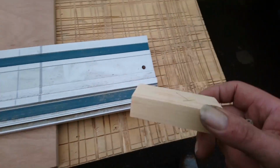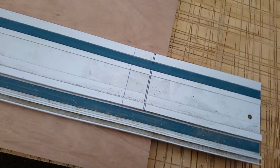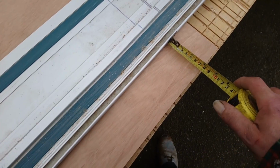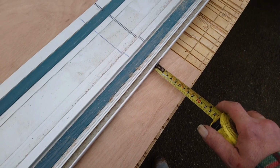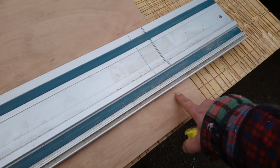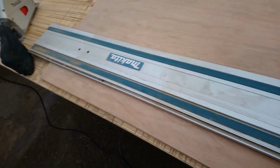No, I've just cut one. Go in there. Won't be needed, but save it anyway. And then for the fascia, I need 260. That gap there is 75mm. I've got 3 of these to cut, so I'll find a little block or cut one 75mm and do the same again.